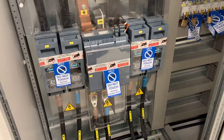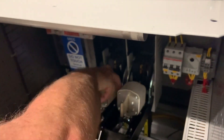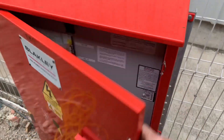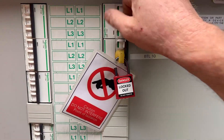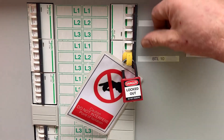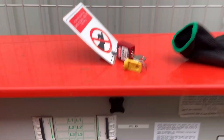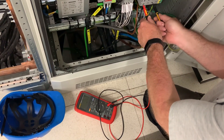We are now going to prepare the main circuit for energisation. We installed the 630 amp fuses on the outgoing supply from the rectifier unit to the distribution board. We are now going to energise up the rectifier panel on this temporary supply and then check we have the incoming voltage at the correct level so we can energise the electronics on the first module of the DC rectifier panel.